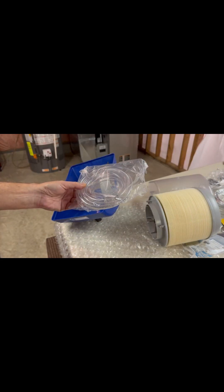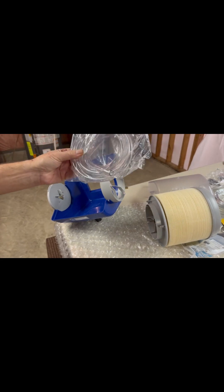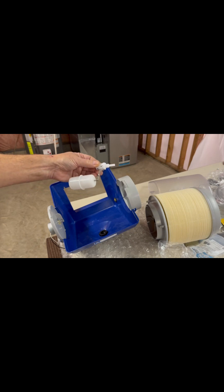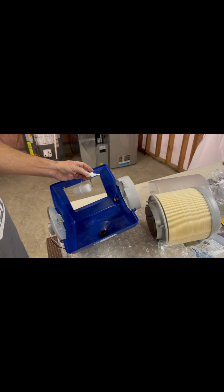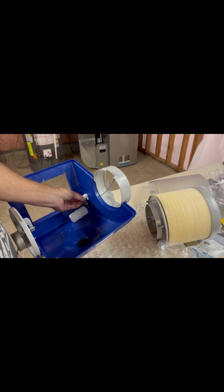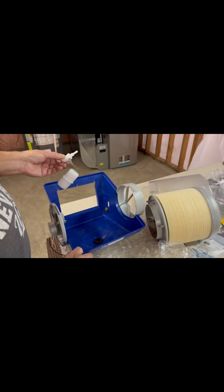They include a length of half-inch hose — hopefully it'll be long enough; the drain for my furnace is right behind so it should reach. This is the float valve included with the humidifier. I'm not overly impressed with the quality of it, but we'll see how it goes. The float valve fits into the slotted hole, and sliding it up and down controls the height of the water. There we have the float installed.